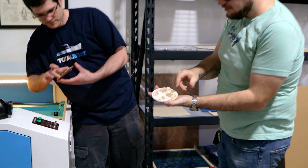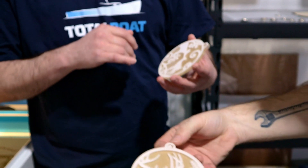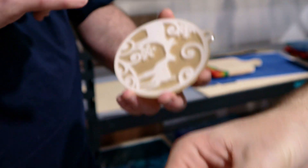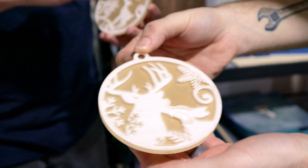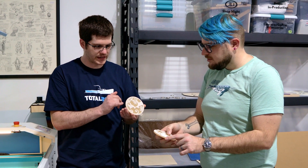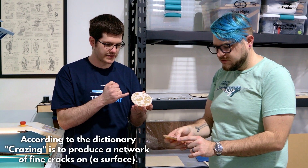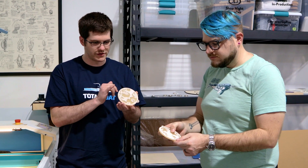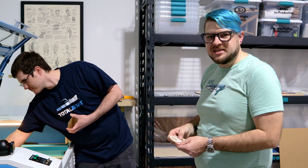Philip, the finish on these is a little bit rough, but you said you clean these up. How do you clean up your acrylic pieces? This is all the dust left over from the etchings. I use a microfiber cloth with some alcohol on it and all this dust wipes away. There is a little bit of a risk using alcohol — if you get it on the edges you can get crazing and see tiny little cracks, so try and cover just the surface and don't clean the edges.